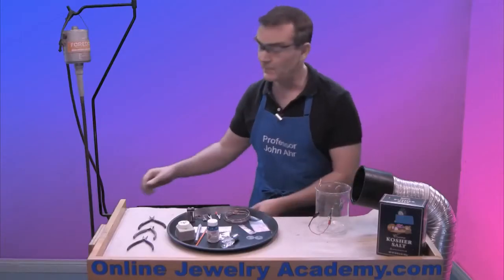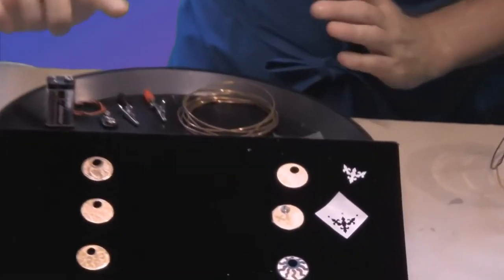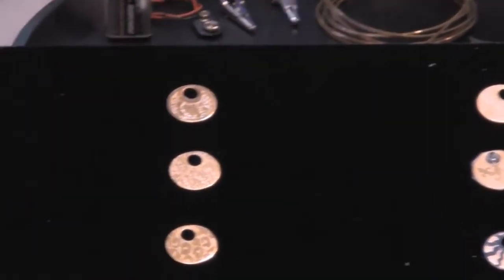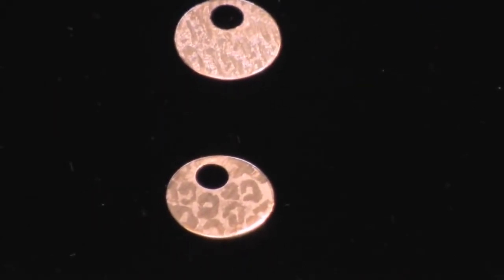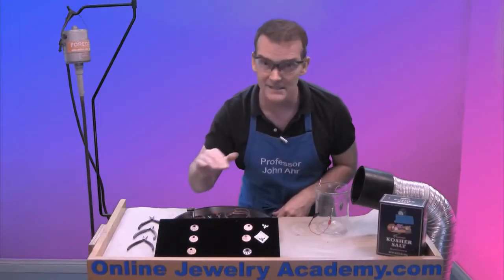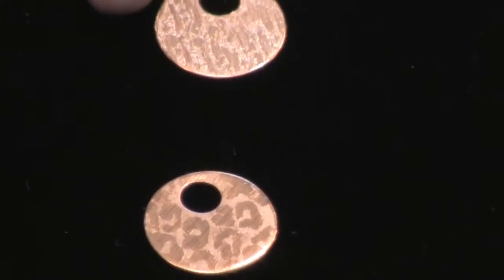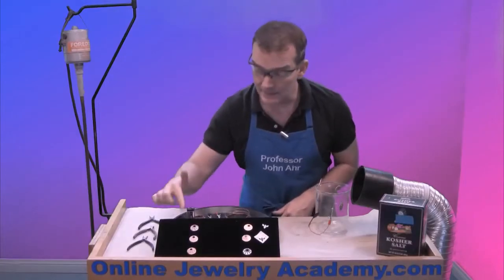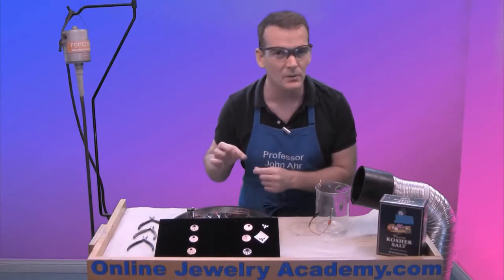Let me show you some examples that I've made to better demonstrate this project. Now, I took an enamel paint pen and applied it to one of my test discs. But the enamel paint pen wore off after about 8 minutes. So this piece was only in the salt solution for about 8 minutes, and I got a very hazy edge, not very deep, and all of the paint pen disappeared. So this one is a combination of permanent marker and the paint pen, but after 18 minutes, those materials disappeared and I got sort of a rough etching that didn't show me great detail.